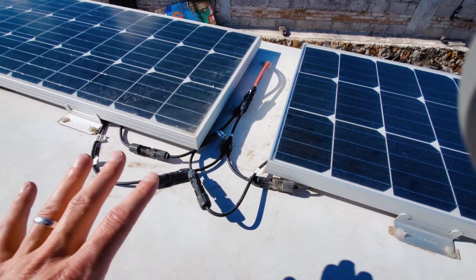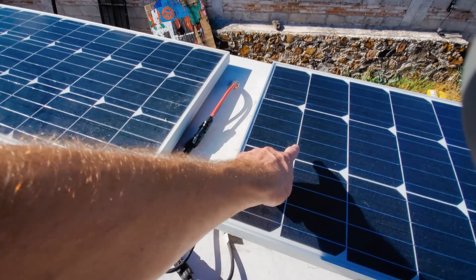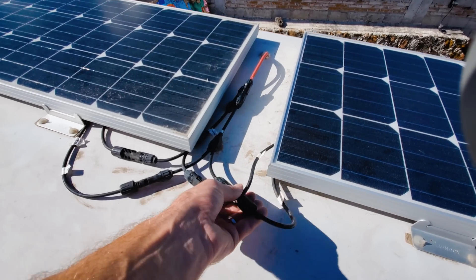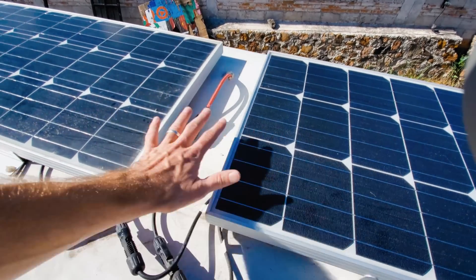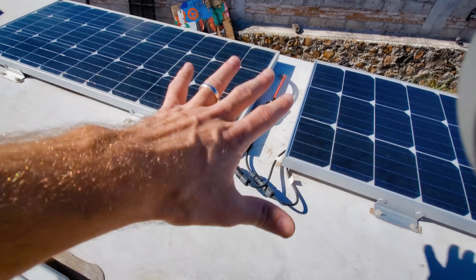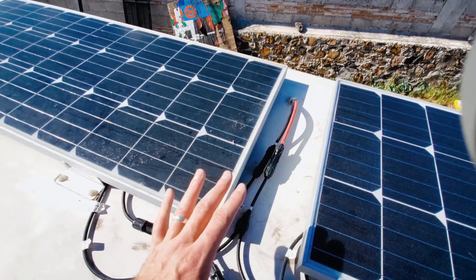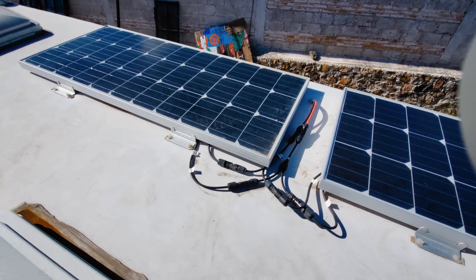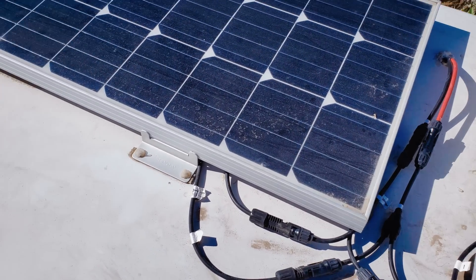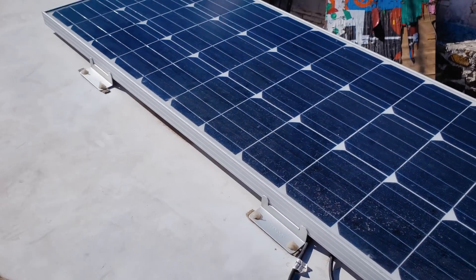You can actually control that up here too. I could run these in series, which basically means I cross the positive and negative from one panel to the other, then take the other positive and negative and run it out to leads going down on the other side — which would basically tie the voltage together and give me a 24-volt panel system instead of 12-volt. That doesn't mean I'd get more charge power; the voltage would just carry better to the charge controller over a long distance. Ultimately, my amps at 12 volts would not change. For a small setup like this, the voltage of your panels is not that critical.